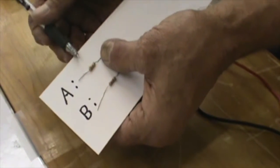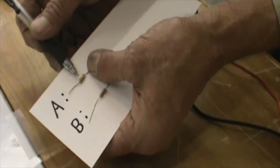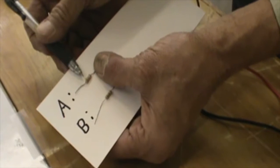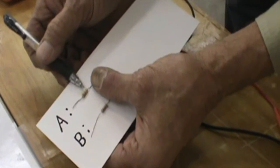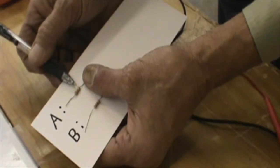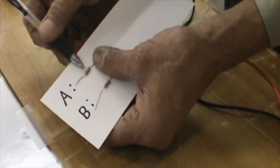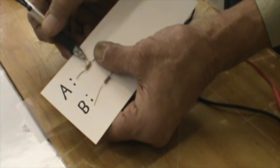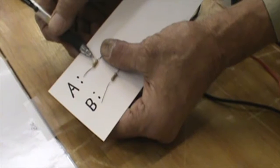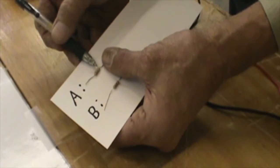You can have a 5%, 10%, or 20% tolerance, contingent upon the color. This specific resistor is stated to be 20% tolerance. That's incorrect. This is a gold band, which is a 5% tolerance, meaning that this is a 100 ohm resistor. So it would be plus or minus 5, not plus or minus 20. 20% would be if there were no color at all on this band.